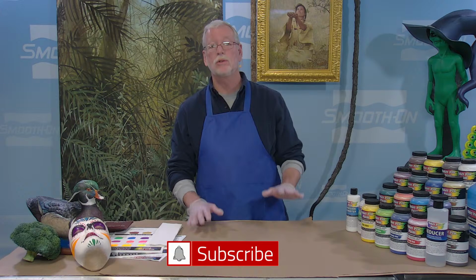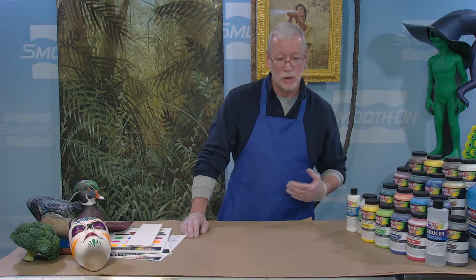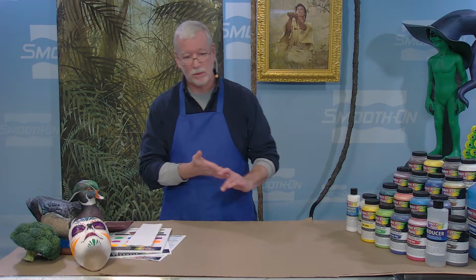There can be some trickier pieces where, say, you're casting a urethane foam into a silicone mold. And we have a release agent, Ease Release 2831, so it's more wax-based. That's harder to get off the surface, so you could use naphtha. And if you can't get naphtha, you could use Coleman fuel or camping fuel, and that will take that off. So that's real important with the release agents. Some of the problems some people have is they won't get the release off, or they don't wait the full 48 hours. There are two problems, so you really have to watch out for that.